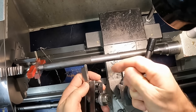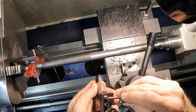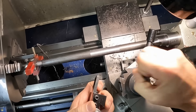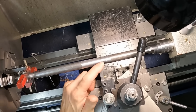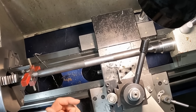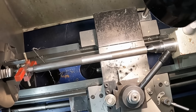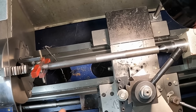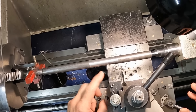I'm not going to take different takes because that would be cheating. All I'm doing is I'm using the other side of my tool, which has a different geometry. And I'm actually extending it further just to prove a point. So now you can see I haven't moved my cross slide — that tool is way further than it was before. I haven't changed anything else, I haven't stopped the video camera, I haven't cheated in any way. All I'm doing is I've changed the tool geometry.